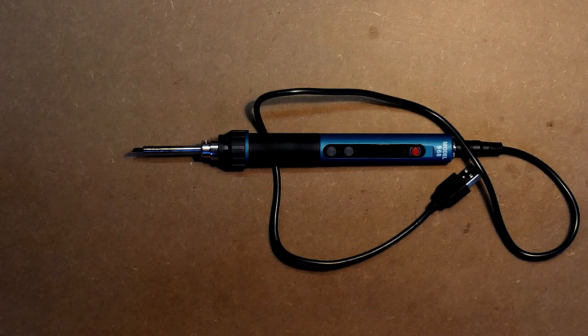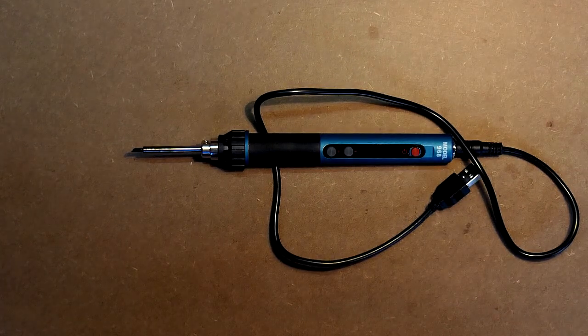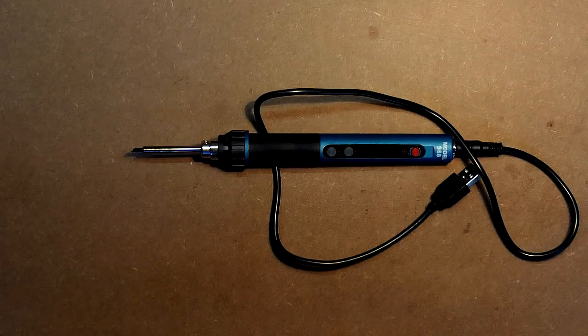The main disadvantage of this device is that it requires its special solder tips. So in case you install the solder tip of other manufacturer with the same diameter, the device will operate only on its maximum temperature, which is not normal at all. Moreover, I would like to warn you that it's not recommended to use the maximum temperature, especially for a long time. And the second disadvantage is that the device is very stubborn and refuses to operate with low-quality USB chargers. It works only with stable 5V 2A output power sources, but 3A output is much better.